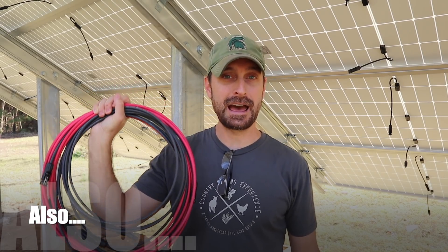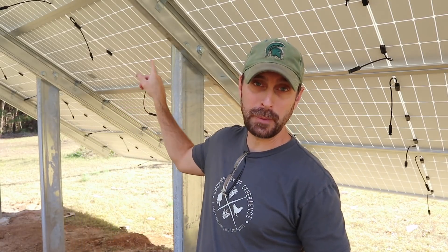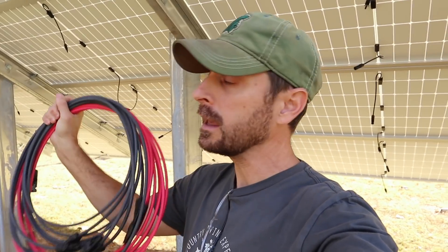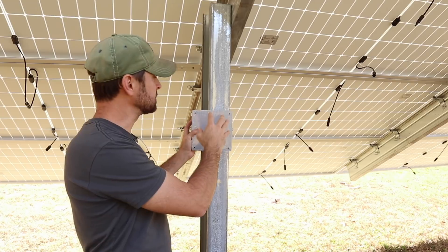The number of jumper wires I have is not enough. It would be enough if I was just running one long string in series, but I'm going to need some extra ones to connect the two series-parallel strings — those two sixes. And the distance from the panels over to where I need to put the combiner box is greater than anticipated. I want you to head over to Signature Solar — you can click the link in the description below. They've got great deals on everything you need for your entire system and are very helpful for DIYers setting up their own systems. It's not really going to matter where I put the combiner box because I'm still going to need extra wire to reach wherever that is.